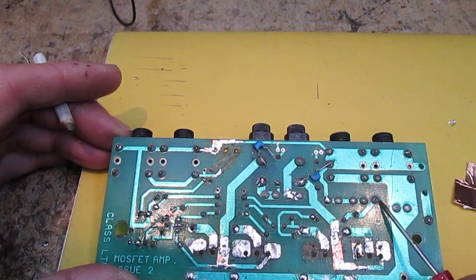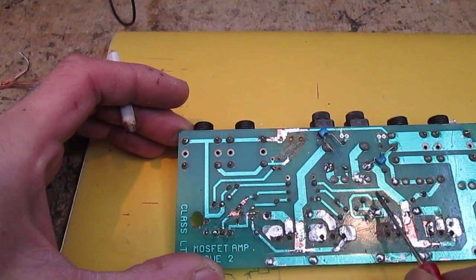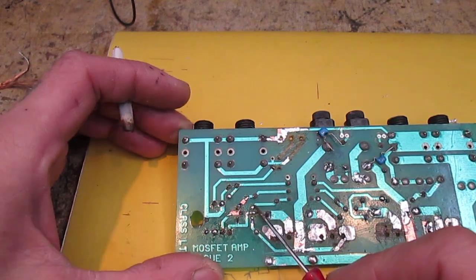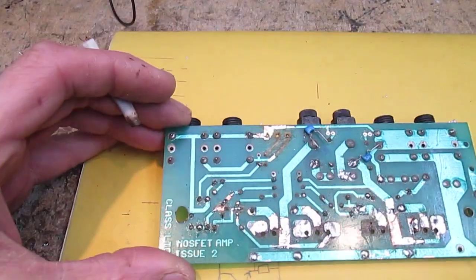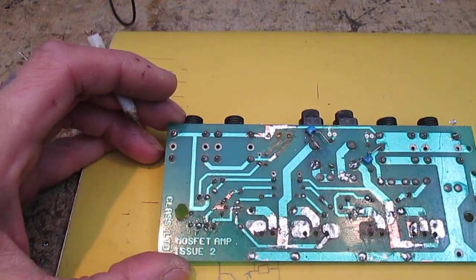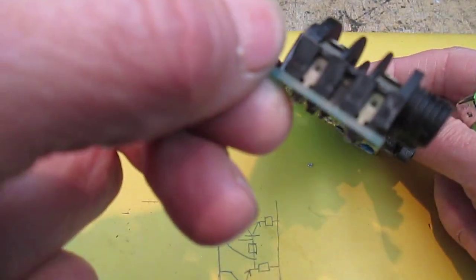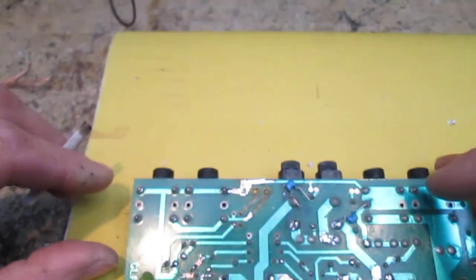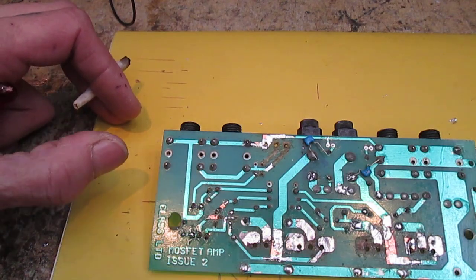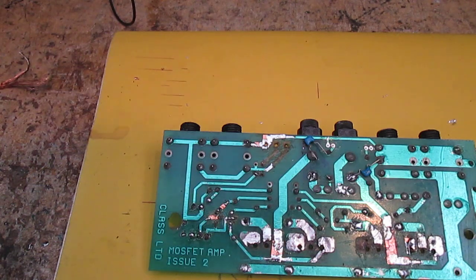The resistor drop, see, and then that goes from there to there, down there, through a diode, through there to, I think it's the emitter of, and I've got the ZTX 653 back in, and then I've fitted a, what have I fitted? A BC556 PNP. This is the last time I'm doing this because I can't really spend any more time on it, especially if I'm getting nowhere.